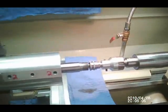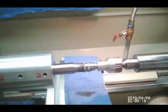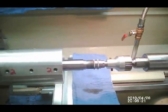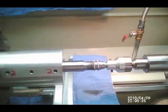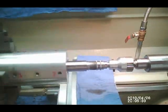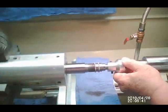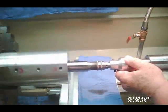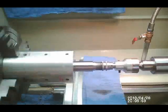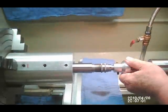We're moving our reamer in until we feel the touch — it'll be 15 thousandths off. There's a small gap there. Resetting our tailstock dial to zero, backing it off 20 thousandths, then starting up the lathe. We bring the dial indicator back to zero where it should engage, and take it in 15 thousandths until it hits the locking collar. As soon as it touches the locking collar, we back off the reamer. We've now taken a 15-thousandths cut — clean out the chamber and take another measurement.